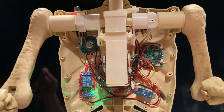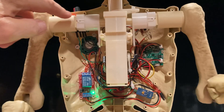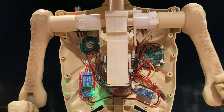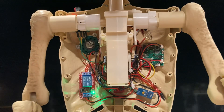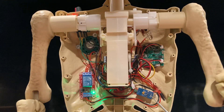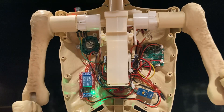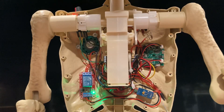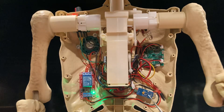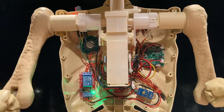That's right up here at the top, right behind the arm joint here. I can remove this to show that better. And I added a pulse generator here — a 555 pulse generator. And I put a 0.47 microfarad capacitor in parallel with the other capacitor on board here, so I could slow the speed down a little bit.